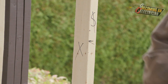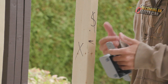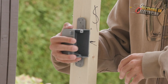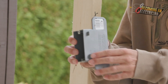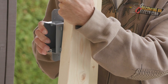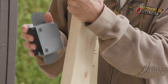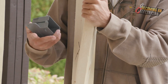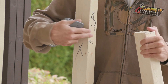Let's do a quick recap before we actually install the box. Installing an electrical box is a really simple process, but it's all about getting a good install. You don't want the box to be slanted. You have your ears right here, and you want to make sure those ears are flush — you don't want them sticking out, because when they drywall it, your box sticks out and it's a nightmare to fix. A good box install is going to make your life so easy as an electrician. Depending on your prints, you have to look at how many layers of drywall and plywood are going on this wall.